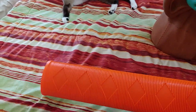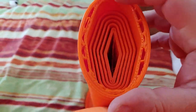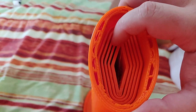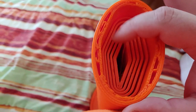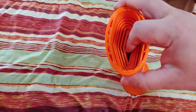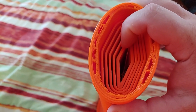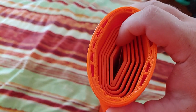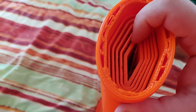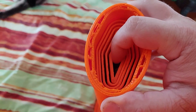It prints surprisingly fast. I printed these every other — so I printed this piece, this piece, and this piece, then this piece, this piece, and this piece — two prints total. By printing every other, I ensure there's a large enough gap that the parts don't fuse together, because they are a bear to get apart. You'd think the gap would be plenty for the scale, but when you're printing with a 1.2mm nozzle, any string that does form is 1.2mm thick, so the string is really, really strong.